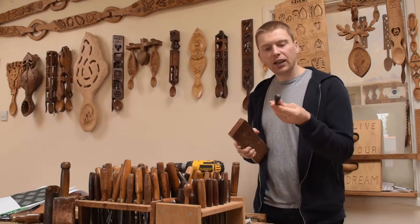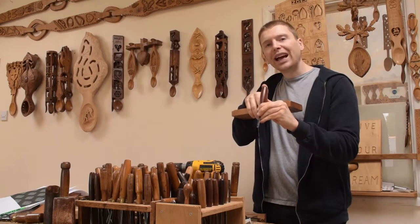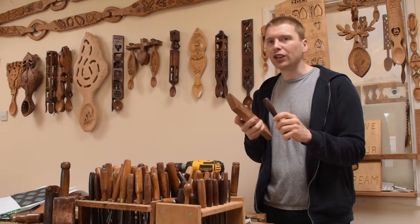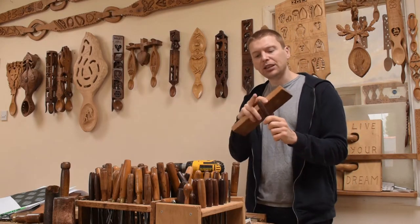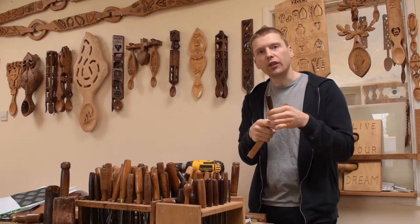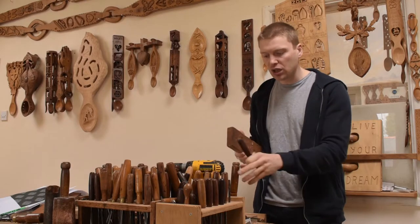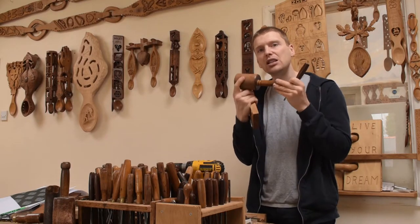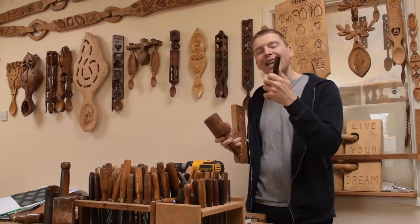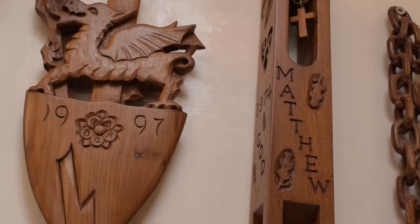One thing as well, when you're working with hand tools, they're usually wooden handles, so to put a bit of extra force on it, don't use anything like a hammer, because you'll damage the actual tops of them, you'll damage the wood on them. Use something like a mallet, either a block of wood or a mallet itself, something that is wooden, because if it's wood against wood, you'll be fine, but if you hit it with something metal, you're going to damage your tools.